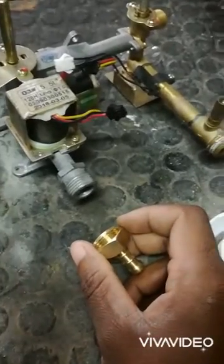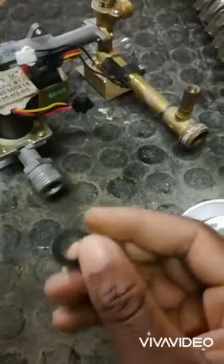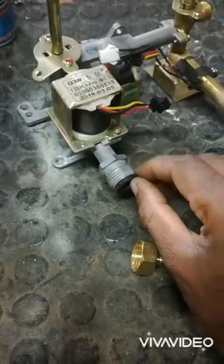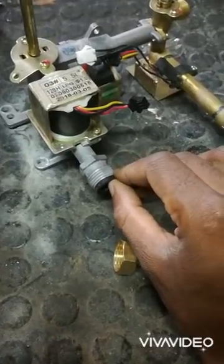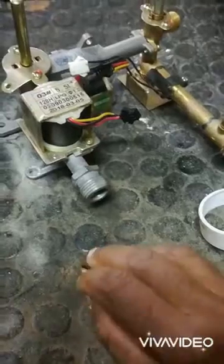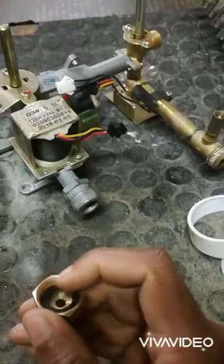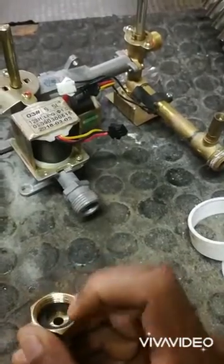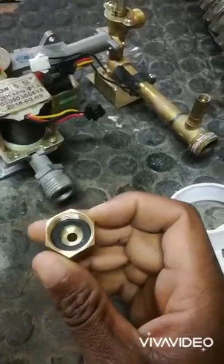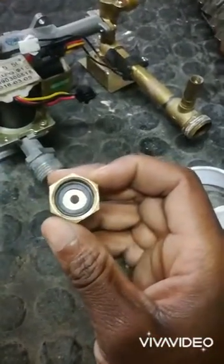So it is recommended that you use O-rings. O-rings fit straight underneath that inlet, and they will go inside your hose tails and seal all gas that is trying to force itself out of that fitting.